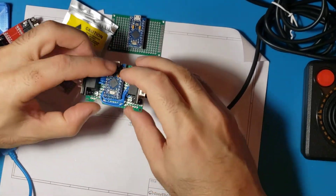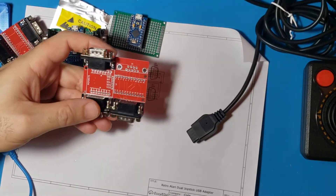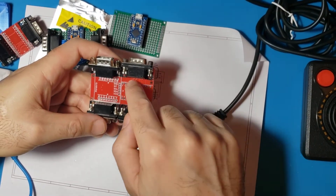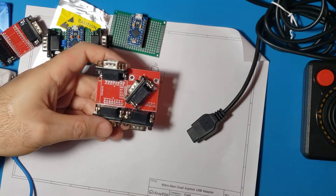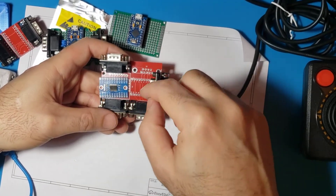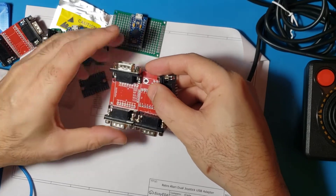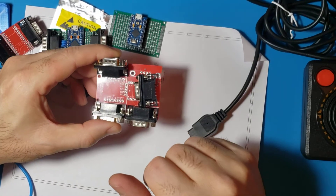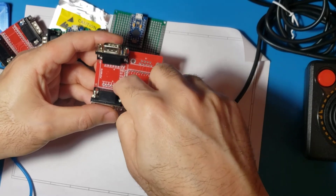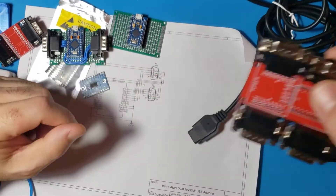Here's the 4-port version I was talking about — it's got four ports. The Arduino goes here, but because it doesn't have enough ports, I had to use an IO expander that goes on this side. It'll convert the SCL and SDA signals from serial communication — the programming knows how to talk through a couple of pins into these — and it converts serial to parallel, so you get a whole lot of other ports and it becomes functional.